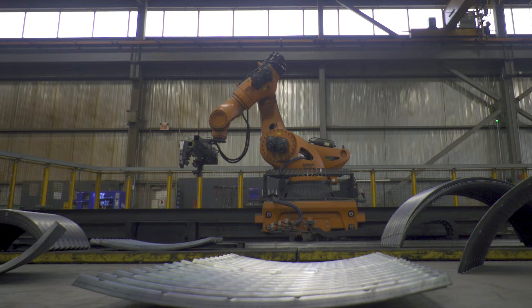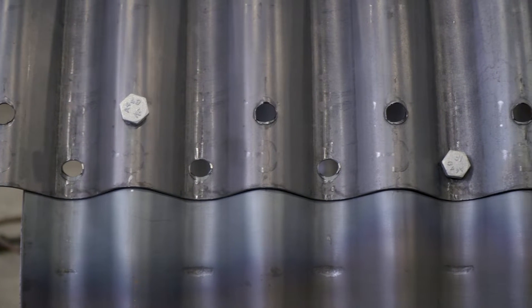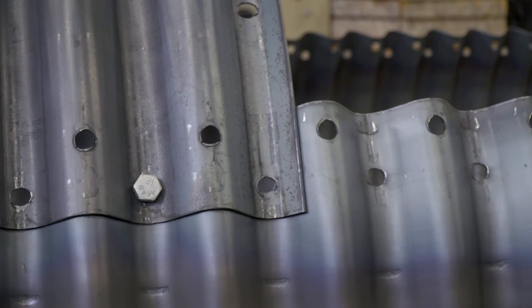The size of the plate is identified by the number of bolt hole spacings. Each bolt hole spacing is called an n. For example, this picture shows a 5n plate, which you can determine by counting the five bolt hole spaces. These holes are located on the circumferential seam — the curved part of the plate that goes around the perimeter. The other joint is called the longitudinal seam, which is identified by the staggered holes located in alternating peaks along the length of the structure.